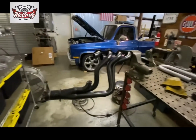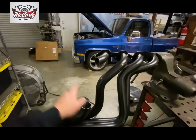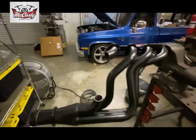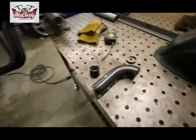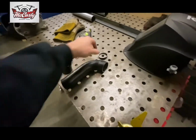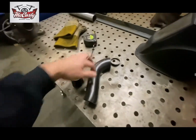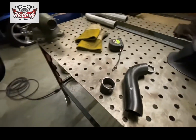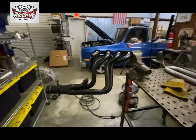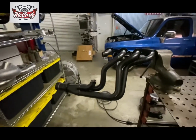So as you can see, I went ahead and took my Portaband over there and cut this tube out. And luckily with this one, as far out as it came, I had enough material that I could just reuse what was there and cut it down. So basically I've got 3 sections now. I've got one small pie cut that'll be up towards the top, and then the longer piece, and then I've cut a shorter piece that's got a little bit of an angle to it. I should be able to clean those up, get it all tacked up, and then refit it one last time.